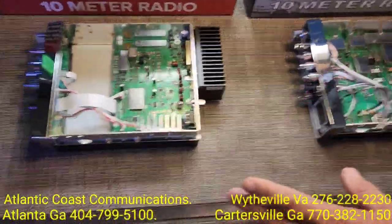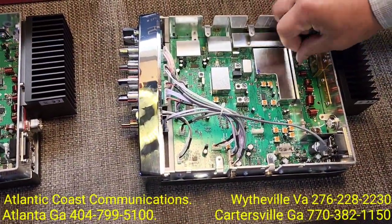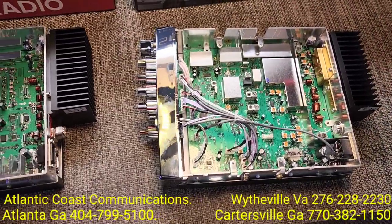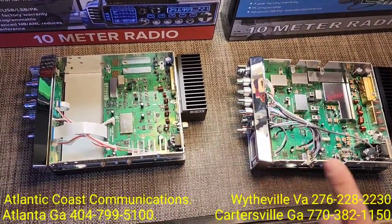On these radios, one of the quickest ways to void the warranty is to have somebody start spreading these coils back here so that the low-pass filter doesn't work properly. All of a sudden you're getting a bunch of extra power the radio doesn't actually put out on channel. If you do that, you're losing your three-year warranty. Don't do that.